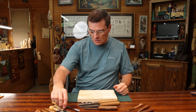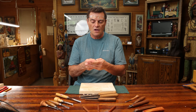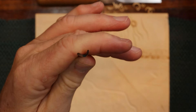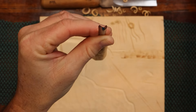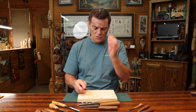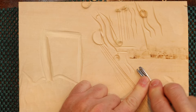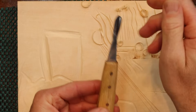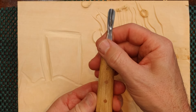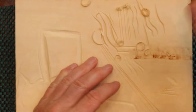That's a good way of getting better acquainted with your tools. Another tool I like is the soft V — you can see here on the camera it's not as pronounced as the other V-tools. It's a very good tool for softer features; I use it on lips and different carvings, even hair. It's almost like a U gouge in a way but it's called a soft V. Mike Shipley used to make these but he no longer makes V-tools and U gouges — only knives now — but you can get them from different wood carving stores and supplies.